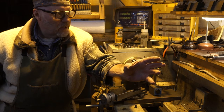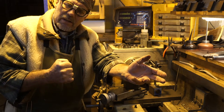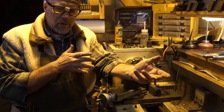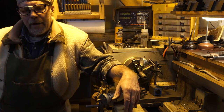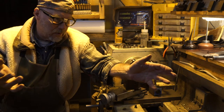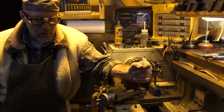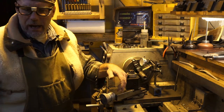I can subtly play with the headspace. It started because I put fire form rounds in so tight it's hard to get the gun closed, and they fall out so loose I'm not happy with them on the next firing. If I set the headspace a half a thou long on my fire form barrel, the brass goes back in and I can fire form, load brass, and take it to a match the next day. Even if it falls in just a wee bit, I can always size that back later. A little bit of feel just reassures me everything's cool.